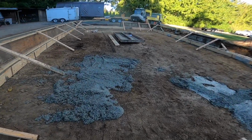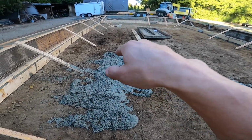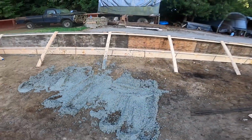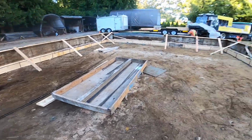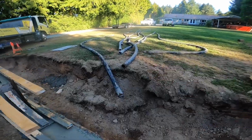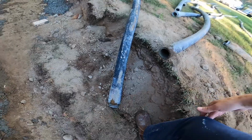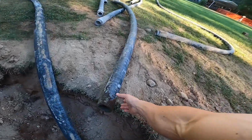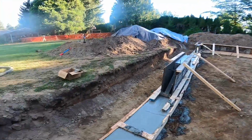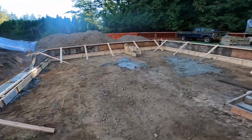Do not be in a hurry. One thing we did wrong there, 100% the guy on the end should have a hard hat and most definitely safety glasses on. That was overlooked. That was wrong, but that's a major thing that should be happening. The other thing is single-ended hose on the end when you're blowing out. You blow through a double, and if that gets wild, that will literally kill someone. So blow it out through a single-ended rubber, unless you're blowing out into a blowout box or a proper apparatus. Always a single-ended hose.